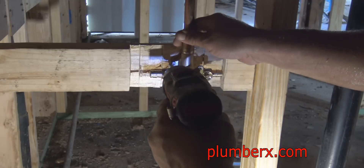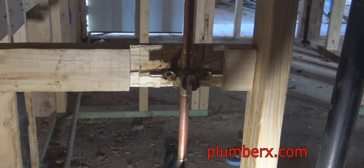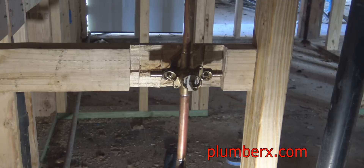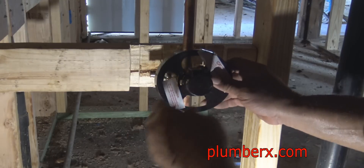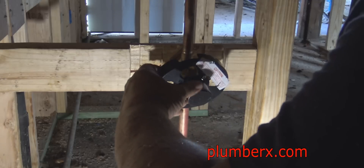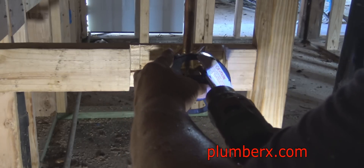What I usually do after I use screws like this — they're going to protrude out from the backside. So once I'm done screwing it down, I just take a pair of channel-lock pliers and break off the back end real easy, and it'll be nice and flush with the board. And again, we want to keep this plastic cover on — it's the guide for the drywallers and tilers to know where they're at and to make sure things are done properly.